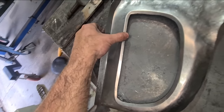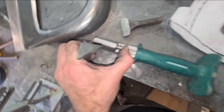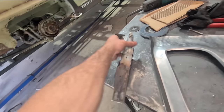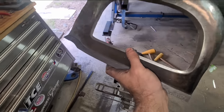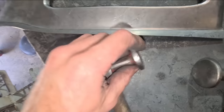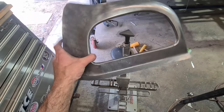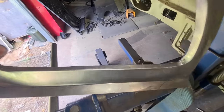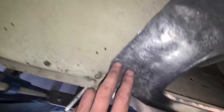To tip the flange over by hand instead of using hammer and dollies, I use this little stake holder I made for the Jonesway tool — it's like a little quick-release chisel. I made a little holder for all the dies because they're such good shapes, and then I can put them into the stake holder and use the dies in reverse — actually hit the piece over the top of them. I'll switch over to a high crown hammer for most of this work because if you use this hammer and haven't clearanced the corners off, it'll just smash in here and leave bad marks. Before I used this, I was just using the corner of the bench, the end of the rotisserie — anything was a dolly. Just got to make life easier for yourself sometimes.